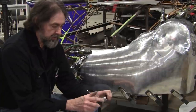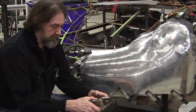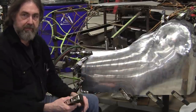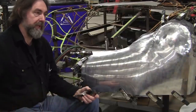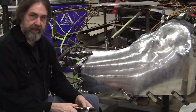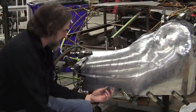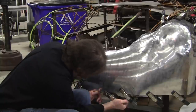And then I put these little rubbers in here. I used to buy neoprene rubber from McMaster-Carr, but it was almost as expensive as the clamps themselves. Then I found out that you can get some nice rubber from Tractor Supply. They make these nice heavy-duty mats, and I've been cutting those up. But you can also get an old transfer belt. Some of them are about that wide or so. They're all reinforced with linen and cloth or whatever. Somebody gave me a section of that, and those worked really good. It allows you to clamp really, really well, and it's a soft bite because it has the rubber on the jaws.